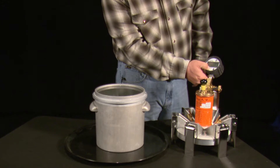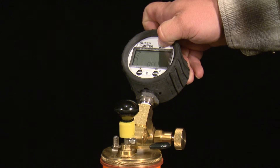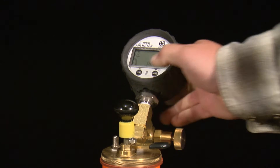To perform the SAM calibration, the first step is to turn on the SAM gauge with a long press of the power button. Zero the gauge by holding the menu button until test mode is aborted and PSI is displayed in the text line of the gauge.